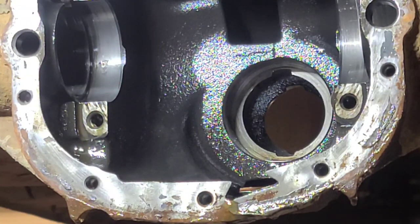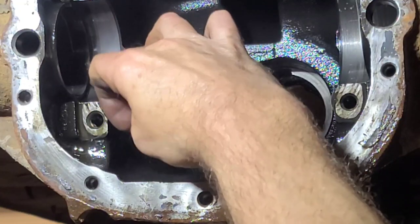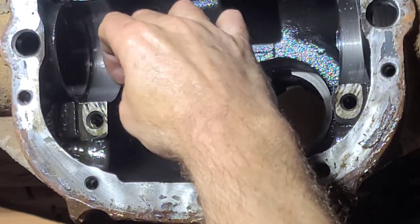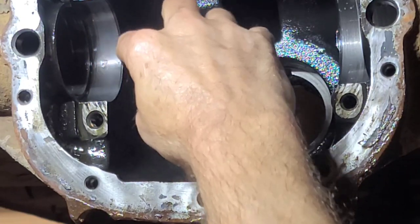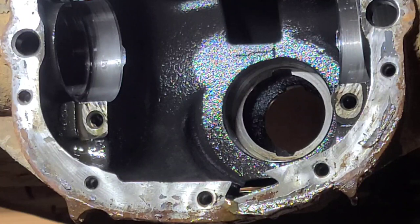It's like a piece of flat metal that was stuck in behind the bearing. That would have put a stress on that bearing. There's a dent in the actual housing - I'll have to clean that up with some emery cloth. There's a little impression in the housing where that bearing was crushed into the cast. Oh well, that's why we're here.